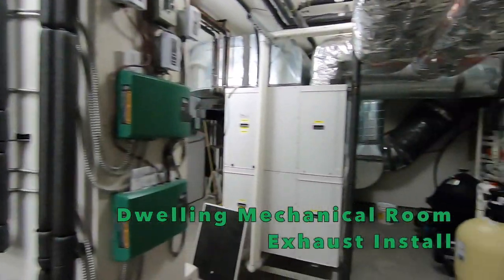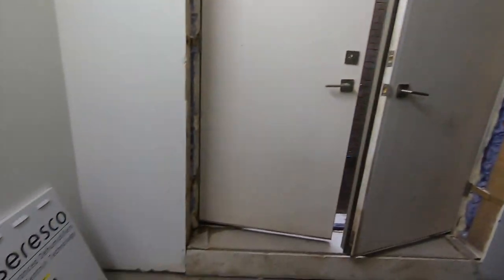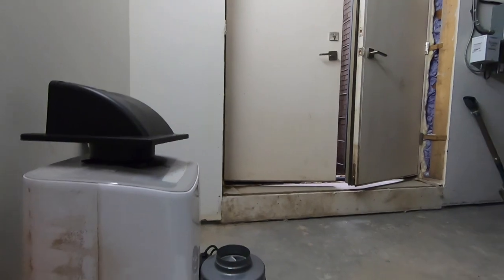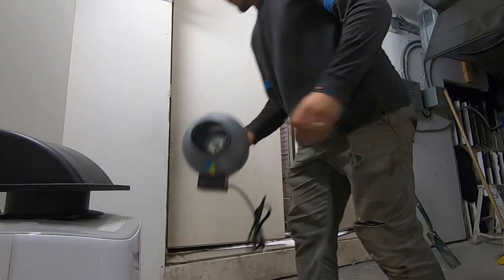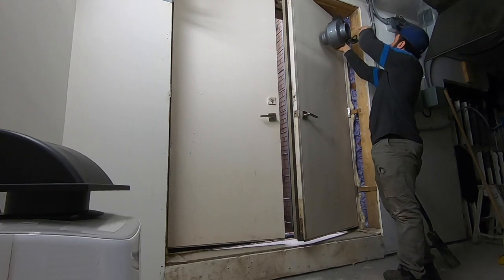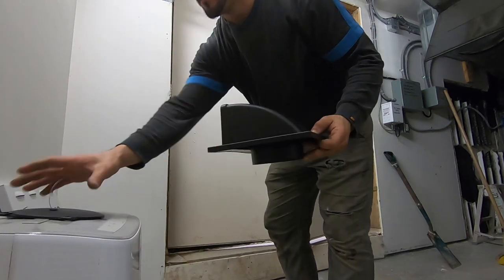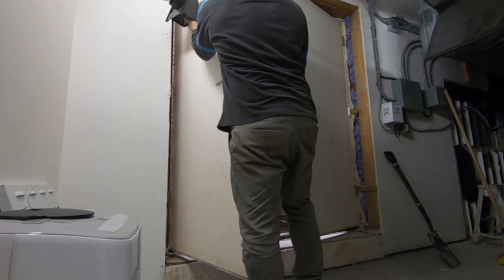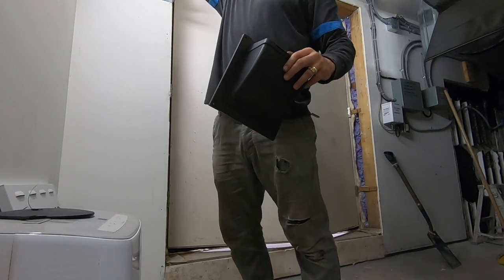For this mechanical room, we suggested a while back that they needed some kind of movement exhaust to try to get rid of the humidity. We ran out of options, but thought of this option: use the door — run flexible exhaust up there with a flapper on the other side of the door. I removed the flapper from this one; it's going to be the intake, and we'll pipe it with flex inside here.